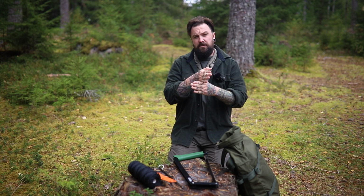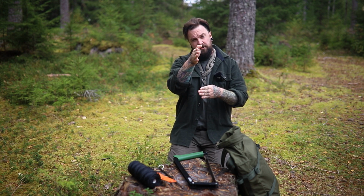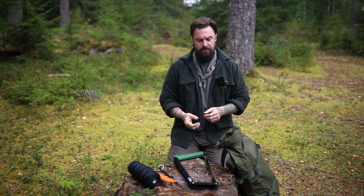If you find that you've bought yourself a blade, you've let it drop, people have stood on it, and when it cuts, the blade constantly wants to curve, chances are the teeth on your saw have just started to swing left or right, and they can be easily straightened up. Another video for another time.